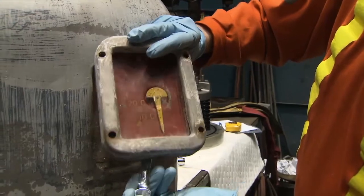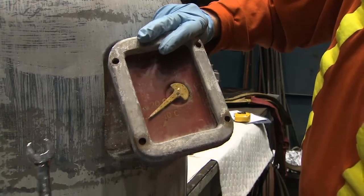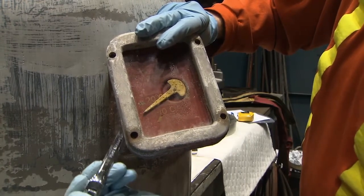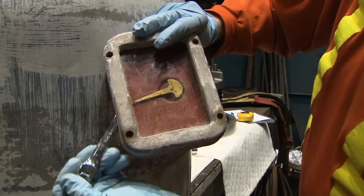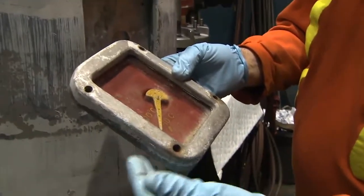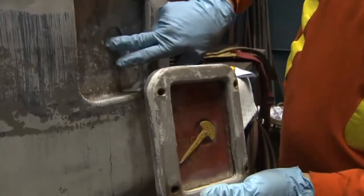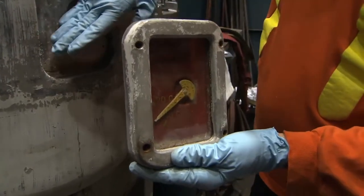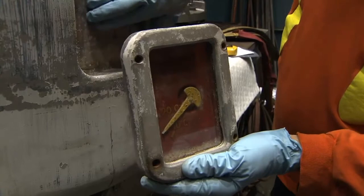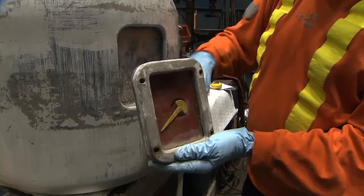The paint corrosion is clearly visible on the indicator arm. The principle of operation is based on magnetism. There is a magnet located behind the indicator arm that is attracted to metal. Here we can see the indicator arm move in relation to the movement of the metal wrench handle. The same thing happens inside the reservoir tank when the bushing is in normal operation. By manually moving the metal arm of the float that sits on top of the oil inside the tank, the magnet can detect its movement right through the tank, because the tank is made of aluminum.